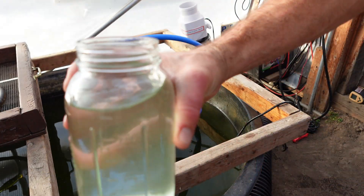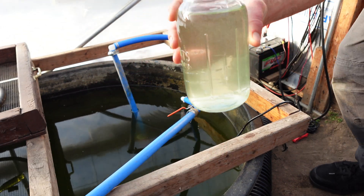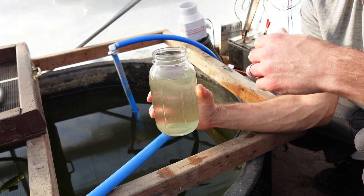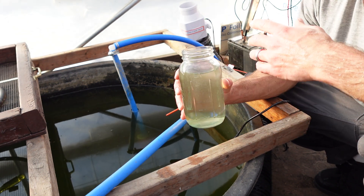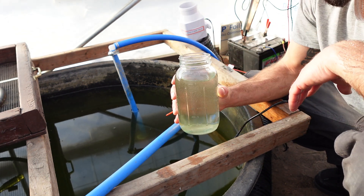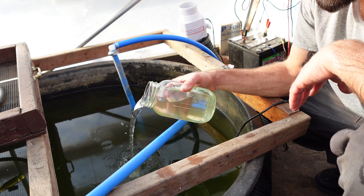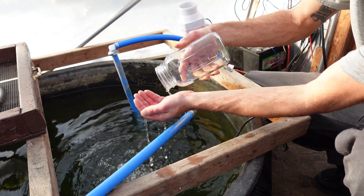The general idea here was to measure for 15 seconds, which I timed out. Measuring for 15 seconds, we multiply that by four to get the per-minute rate. That gets us 12 cups per minute — a little over 12. So we are under one gallon of flow per minute. And this water is physically warm — it's like bath water.